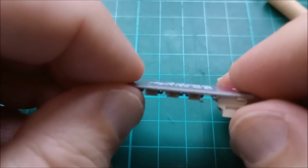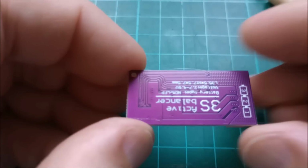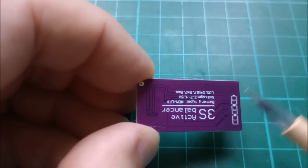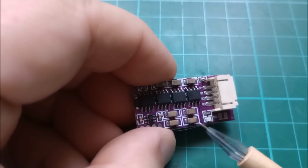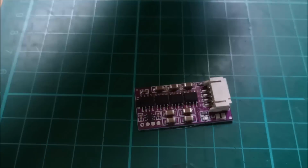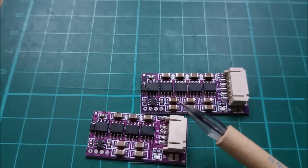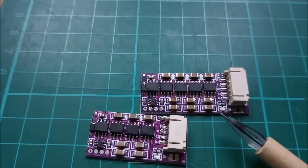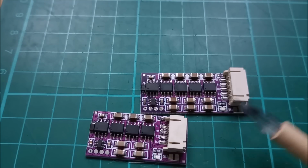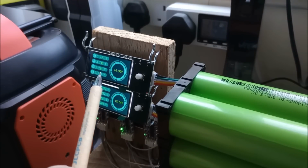this MOSFET here. Oh, what's that whisker hanging off the capacitor there? That's horrible, isn't it? This MOSFET here, which is, oh, I think connected to this point. So I think it's the higher voltage. So it does look like the LED is strapped across all of the cells, in this case 3, and then the one on the 4S balancer is strapped across, it'll be a similar arrangement, 4 cells, but that is only a 3:4 ratio. The brightness of the LEDs is much more relevant to this 10:1 ratio of the 1 meg ohm resistor and the 100k resistor. Right, now let's take a look at one of these Heltec 4S voltage displays.